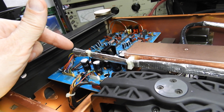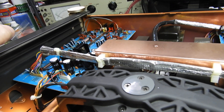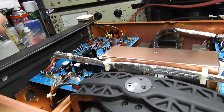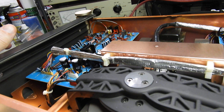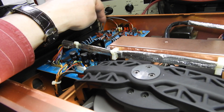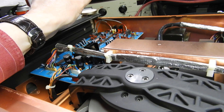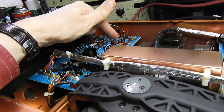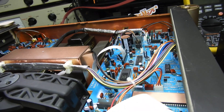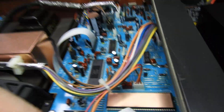This unit has balanced output, but sadly it's just done on op-amps, so there's nothing spectacular there. I tried it in balanced mode but there was just no particular magic. A nice touch is that you can set the zero volts and the output level as well. The ICs and some capacitors have this foil to stop them from radiating — Sony had done that in some units, and you see some chips sport that as well.